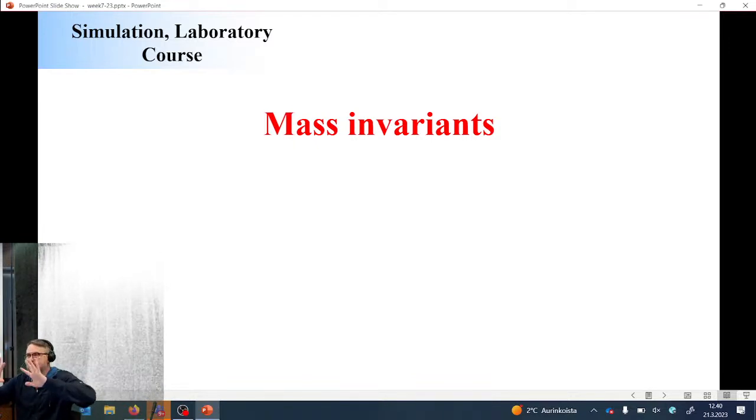deformation and reference motion. Remember what we did here. We started from the concept that we have multi-body system dynamics and the finite element model, and we put them together. When we did that, they need to be coupled one way or another. Generally speaking, you could do the coupling using the elastic forces or inertial forces. And what we're going to do in the case of the floating frame of reference formulation is couple them by using inertial forces.